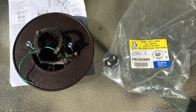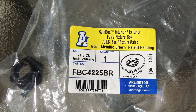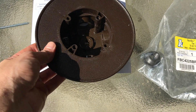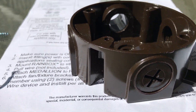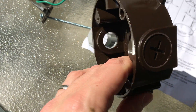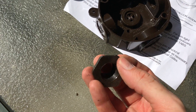The box I plan on using to hang this ceiling fan is kind of special. This is an exterior-rated, fan-rated box made by Arlington Industries. It comes in bronze or white — it's all plastic. This particular one is the bronze color, which is basically a brown. It comes in several pieces: the box itself is a fairly standard plastic exterior box with multiple knockouts for three-quarter inch conduit. It also comes with half-inch to three-quarter inch adapters if you don't want to use the three-quarter inch size.